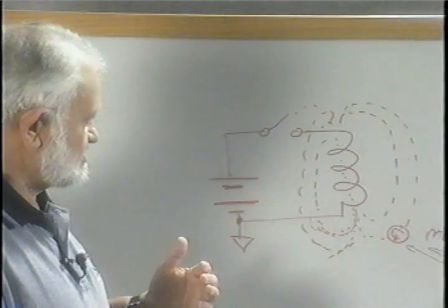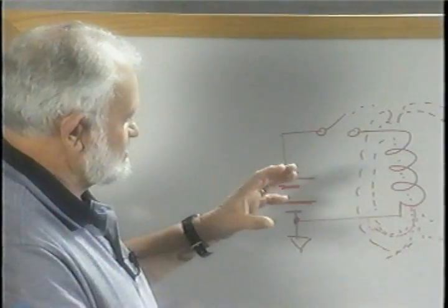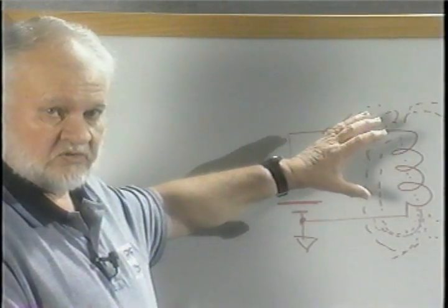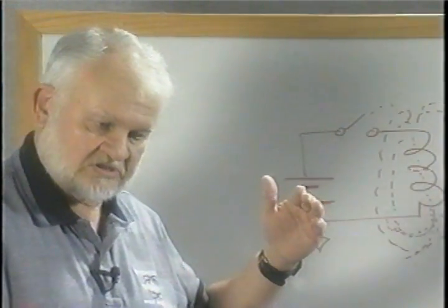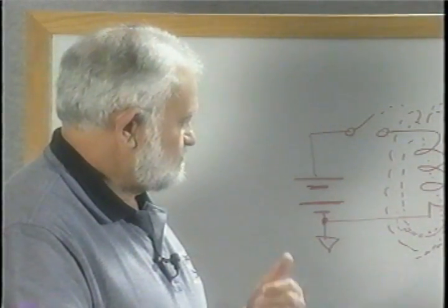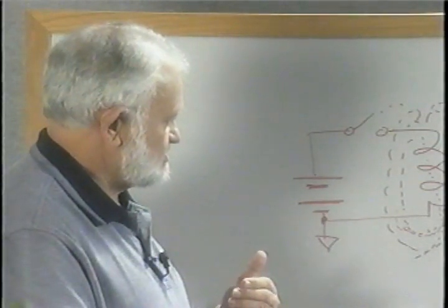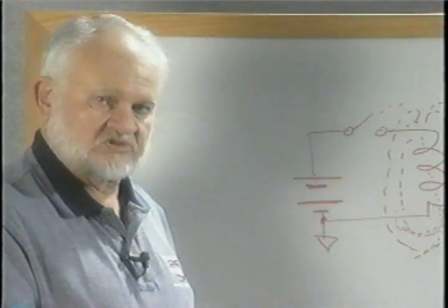The sensitivity is established in 2 ways. The overall gain of the system that takes the signal from the search coil establishes the minimum signals that you can hear. The sampling mechanism that is used also establishes somewhat the sensitivity of the device to different kinds of metal.